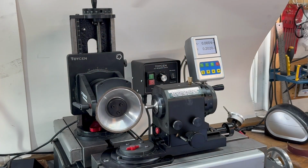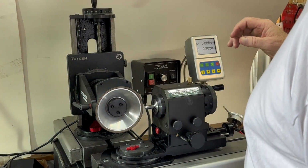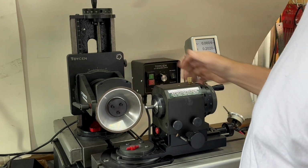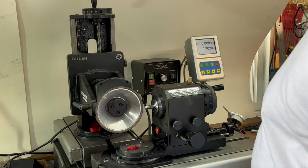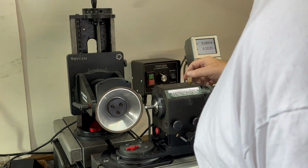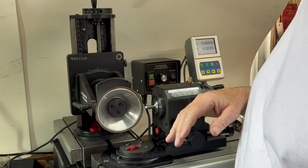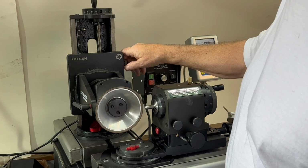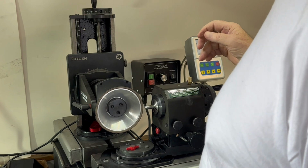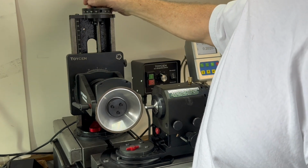Okay guys, this is the JXT. We have one of your tools set up. The basics are, it has X and Y movement. You've got upper X and Y on this spindle. When this is at 0, you're about equal center height. We're going to be grinding the primary, the secondary, and the gash, which has a bit of an angle on it, which is a little weird but easy to set up.